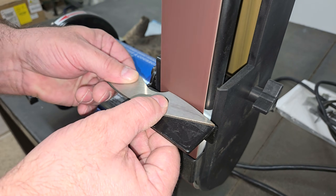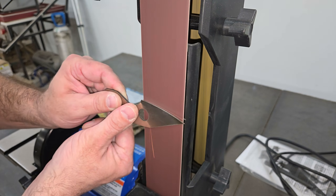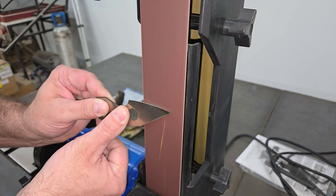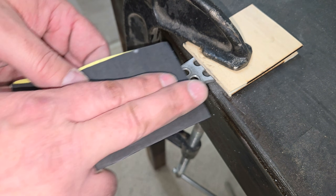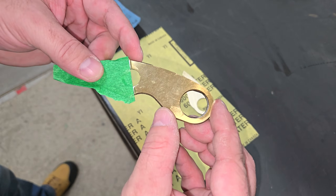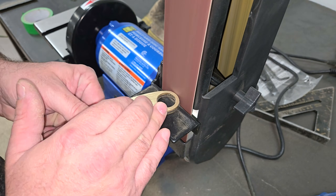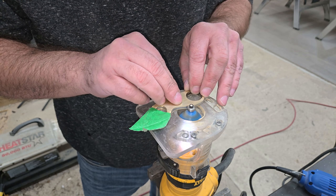Since it can't be heat treated, all I did was clean the edges, bevel the blade, drill some holes, rough up the inside faces of the brass scales with sandpaper, and clean them with alcohol before gluing them onto the blank with two-part epoxy. I didn't bother installing pins to save time, and things ended up a bit misaligned, but it turned out okay with a bit of extra Dremel work. I also used a carbide bit in my trim router to chamfer the edges, before sanding it all down to a satin finish — starting with 200 grit sandpaper and ending with 600 grit.